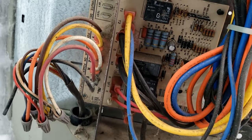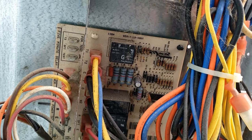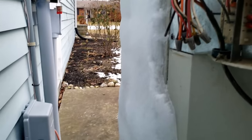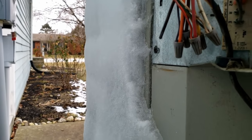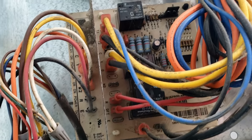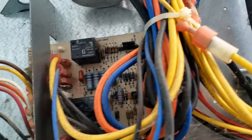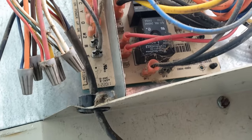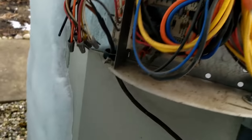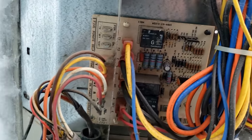Let's go ahead and put this thing into run and see if we can put it into defrost, force it in defrost over and over again to at least get some of the ice melted off. We can melt the rest possibly with water. It's well below 30 degrees and getting colder throughout the week. Defrost is set for 30 minutes — I don't see a speed-up tab anywhere on there.